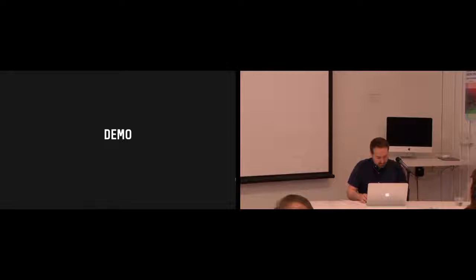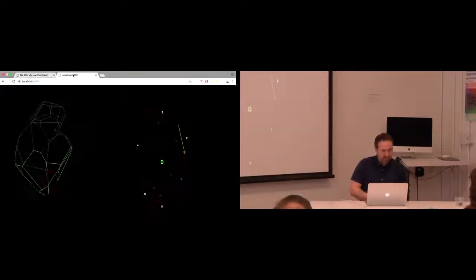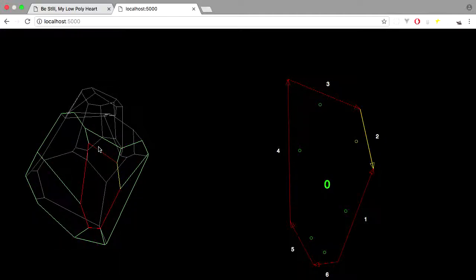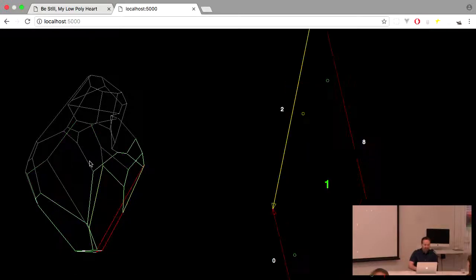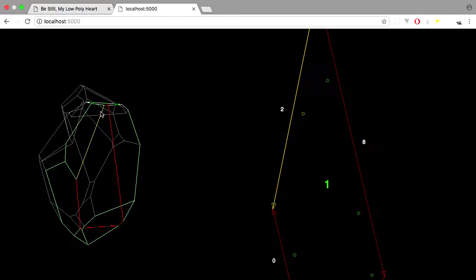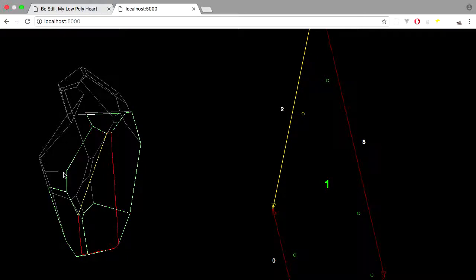This is the little tool I created to pick each face and create an SVG vector output from it. I can iterate through the different edges and select different faces — on the 3D model the red face is selected, and the yellow line is the selected edge. Through the debug console I had commands to add or remove screw holes and move them around, which is important because some faces have very tight surface area where you need to manually nudge connectors so they don't collide with each other. I was able to spit out all the SVG files needed for cutting and all the angles between faces that I could feed into the next step.